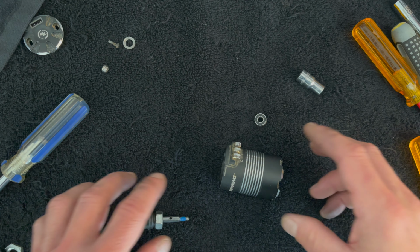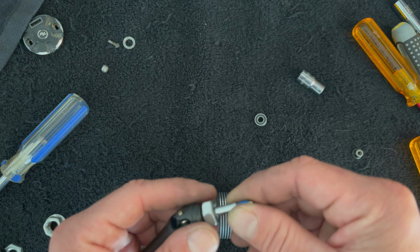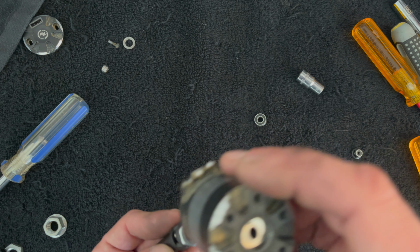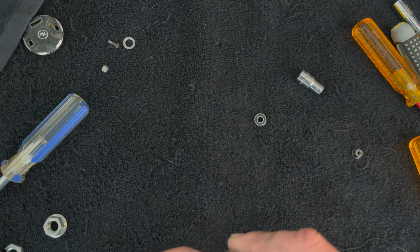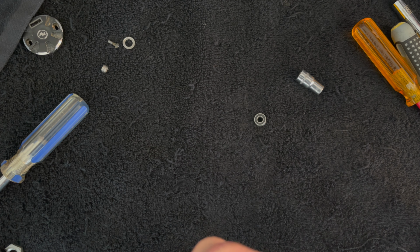All right, don't laugh. This may or may not work. My plan is to use a truck axle, because it's the same diameter as the bearing, slide that through here, and I got a large nut on the end of this so that it presses on the outside edge of the race instead. I'm going to put another one up here, and I'm just going to cinch this guy down, and maybe, if I'm lucky, that'll pull it all into place.